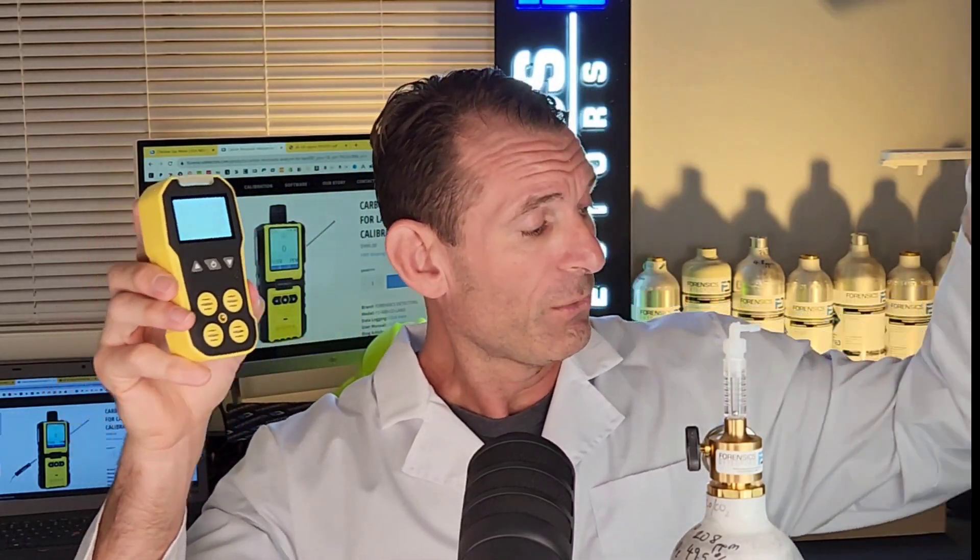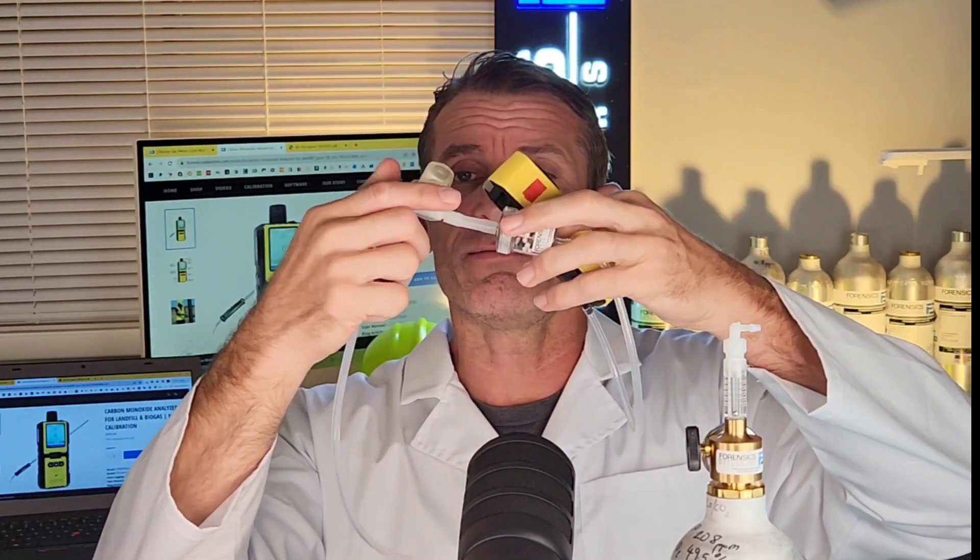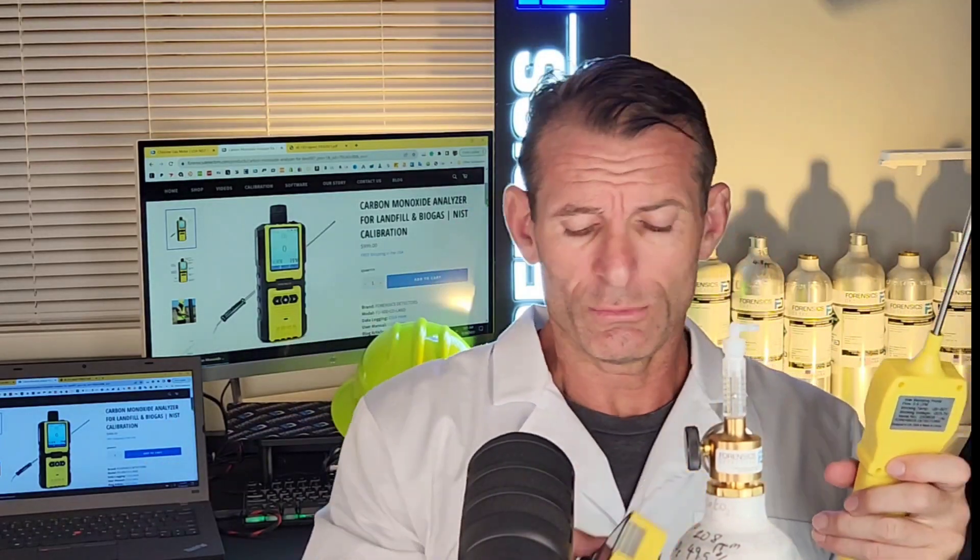Let me show you how it works. Here I have a bottle of carbon monoxide and depleted oxygen — a low level of oxygen — which sort of mimics a combustion sample gas. The first step is to attach the calibration cap on the unit with the screw — just pop it on and give it a turn, fits nice and snugly. The tubing goes to the cap, then through the filter setup, and the other end goes to the pump. At the bottom is a nice barb — everything is barbed — so it's slip-on, no proprietary connections. Then we'll turn on some gas, turn on the pump, and it will be drawing the gas simulating a combustion analysis.